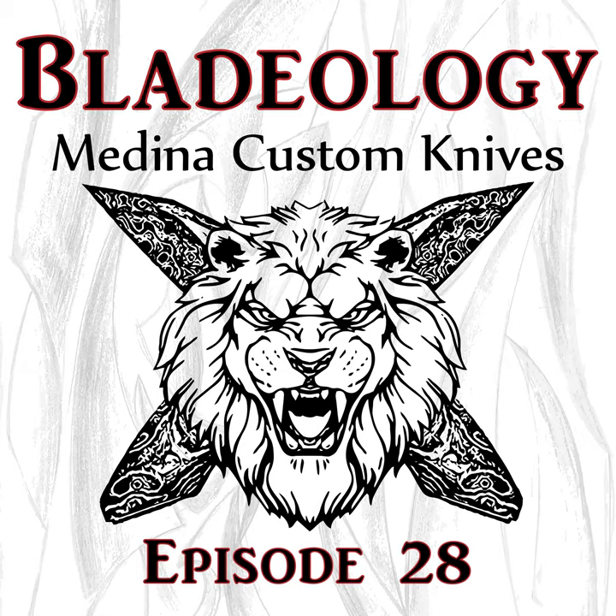For me now, I do hollow to flat grinding. Hollow is easier after a point, but getting to that point is a little difficult — where the wheel actually holds the blade. Flat grinding to me is weird. I hollow grind everything, not that I find one better than the other — just my preference. I do jig my swedges because the swedge is so small I don't want to mess up the blade. The main bevel is more forgiving. I've never really learned how to do a good freehand swedge.